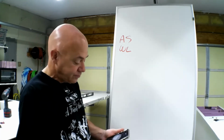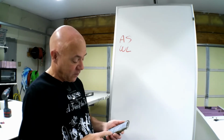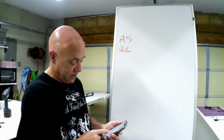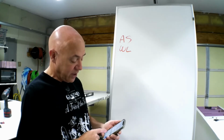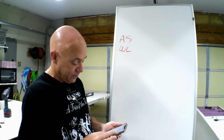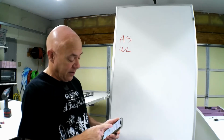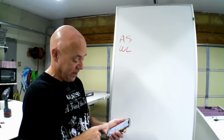If you were to, that's an interesting question. Let's say I got 10,000 RPM. No, they don't go that fast. I think 8,500 RPM is about the maximum. I heard some of the guys doing electrics, and you can find some 16-pitch props out there, but they're very, very hard to find. See, that's 130 miles an hour at 8,500 RPM. So I'm guessing they're coming out of dives when they're going 150 miles an hour. That's not level flight. We've got to keep that in mind.